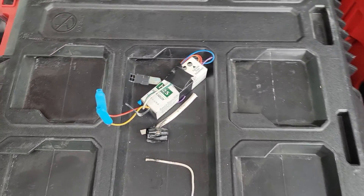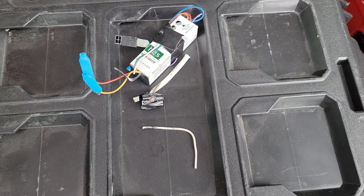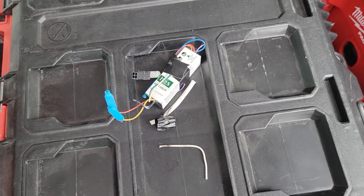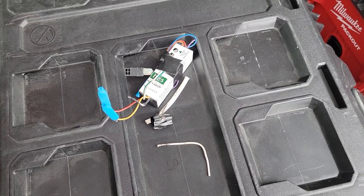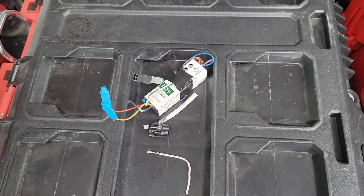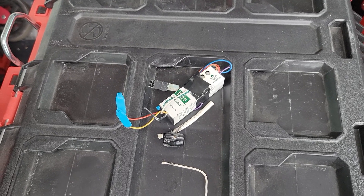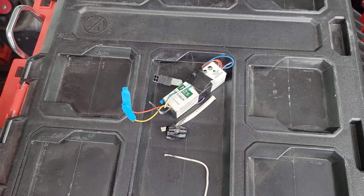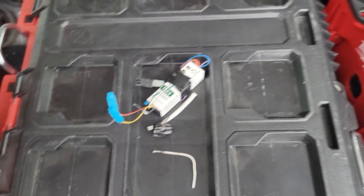The newer models are kind of a cylinder shape. I asked the customer if they put this door on a schedule — he said no. With that information, I explained that these smart packs are really for when you put the door on a schedule, as it holds the voltage at a lower input or output so the strike doesn't get as hot and extends its life. But if they're not putting the door on a schedule, there's no purpose for it to be in there.